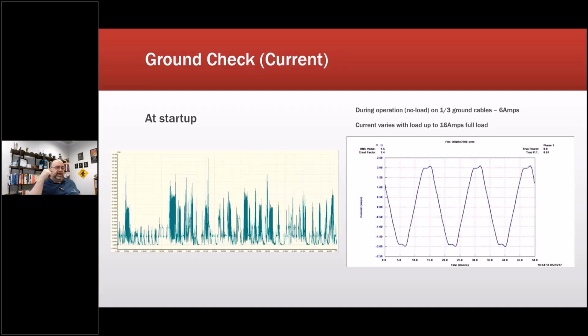The motor was also connected to the building ground, and the whole system was on a high resistance grounding system in which the fuses had blown. So it was a floating ground. So we had a ground loop issue, and a couple other things going on during startup. And it wasn't a cable, it was loose conductors in conduit, which included a ground for a 300 horsepower machine. So we ended up with this stuff here. Well, the insulation system doesn't care.